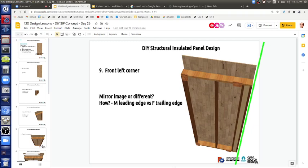Now, 32x16 to where? To the sheathing, exterior siding, frame, those are your options. Inside of the frame? No. You can't sit on the corner of it. Which is it? We decided that it be the framing, because it's the framing where everything sits. For example, the 32x16 second story floor sits on a framing, so you want to have the framing outside edge even with the foundation outside edge, and that being 32x16.